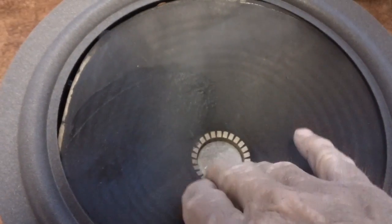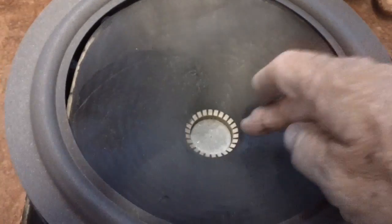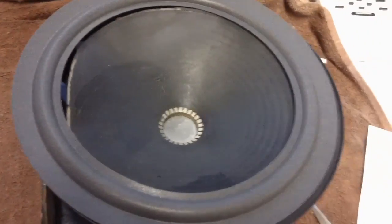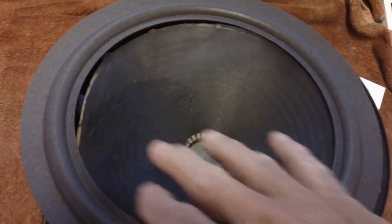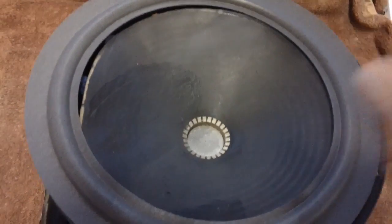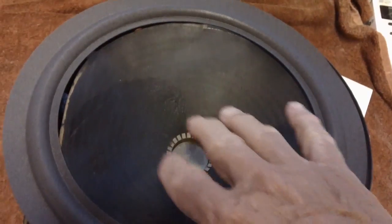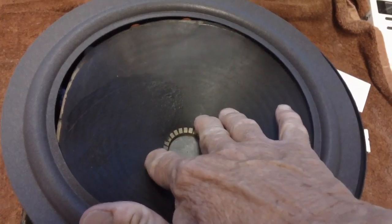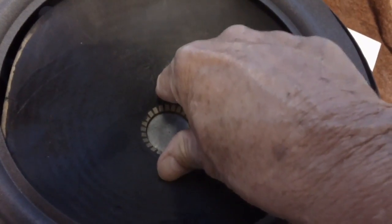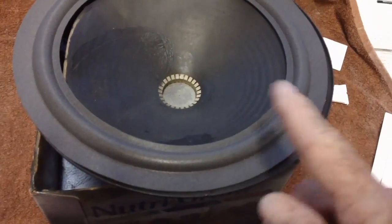Now this cone has really been doing good as far as rubbing goes - it's almost disappeared, just a slight rub. It's pretty quiet once it gets down below where it's supposed to be. But hopefully once I get it cemented to the cone - it says to wait an hour - I think I'm going to let it sit overnight. Then tomorrow I'll be able to pull the surround this way and that way, whatever it takes to get this thing quiet. There is a rub, and if I don't hold it in the right spot, I may never get the rub out. So let's get this foam cut right now, get it overlapped and glued.